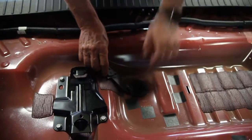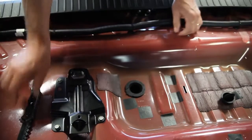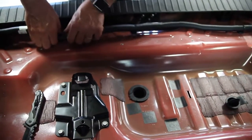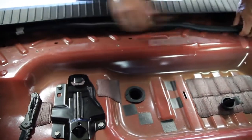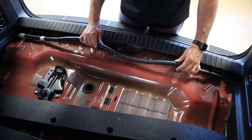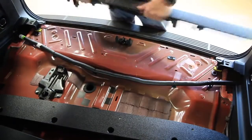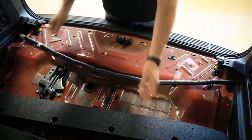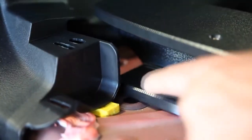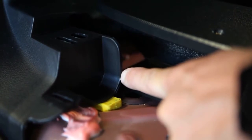Remove the spare tire plug and cut — totally discard. Also remove the plugs that hold your wire loom in place. After removing your wire loom clips, push the loom out of the way. We're going to remove the OEM threshold and place your rear I-beam. Be sure that your I-beam comes in complete contact on both sides of the vehicle with the OEM plastic assembly.